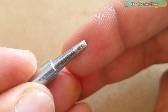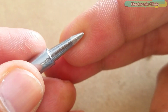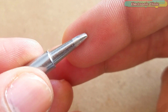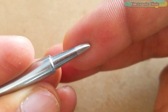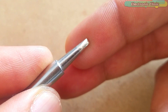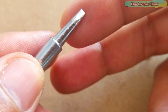This is a chisel type or D series tip, which almost looks like a screwdriver. This is my favorite one. Just like the B series tips, the D series tips are also used for general purpose soldering. The main difference is that the D series tips offer a much larger surface area on the face and tip, due to which more heat can be transferred from the soldering iron to the electronic component, which makes the soldering job really easy.